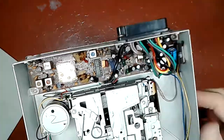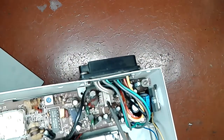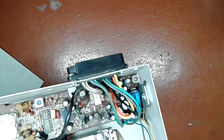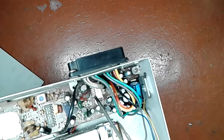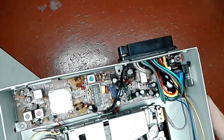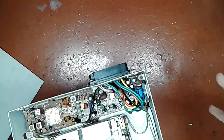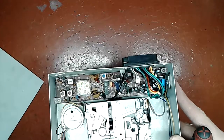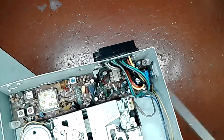And actually this stereo is old enough to use one of these. See that? That's a little transformer. Why is it there? Well, this thing is nothing else than a so-called interstage transformer. These guys used to be very popular back in the day in tube equipment and the early days of transistor pocket radios and whatnot. If you crack open a really rather old pocket radio, transistor one, of course, I don't know any pocket tube radios, you'll see a bunch of these. There will be a couple between the stages and there will be one on the output.